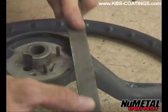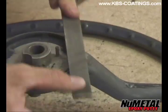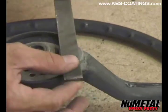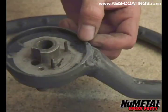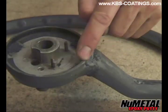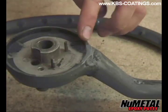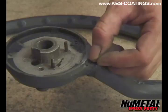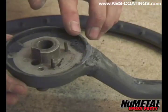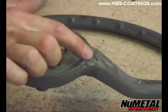I had to go into the file here because some of the material is hard. You can also use a flat file or a round file to reshape certain parts of the wheel if necessary. I've finished here — I can see the edge of where the original crack was, so I've got the material nice and flat right across here. That gives me a great starting point, because I know that's flat and I can develop the shape again around the inside and outside of the centre of the wheel. I've got an area here that I can work from that is going to stay there right till the end.